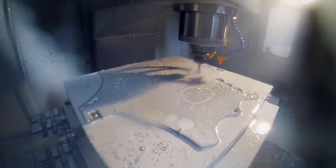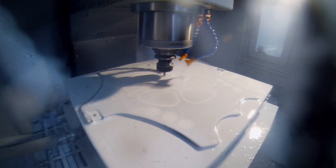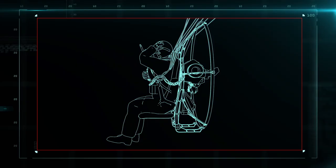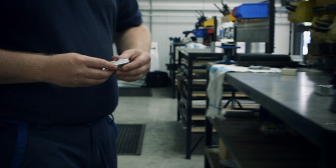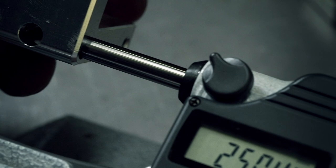Holes are machined out of the aluminum to make the airframe even more lightweight. The same process is applied to all other parts of the airframe, including the pivot arms. The pivot arms connect the base plate and the flyer to the wing. They control direction either by hand or by shifting weight in the harness, leaving the pilot's hands free to hold a weapon, a medical kit, or a camera. The parajet is designed to snap together quickly in the field without tools, so every part is machined and measured down to the fraction of a millimeter.